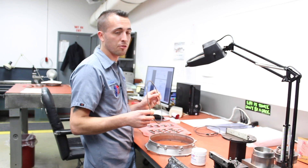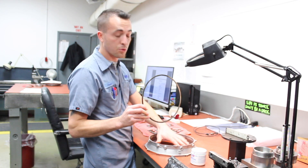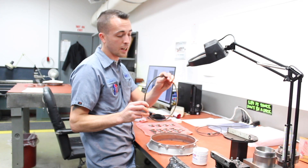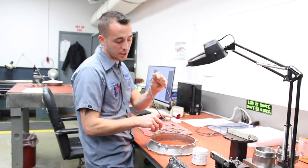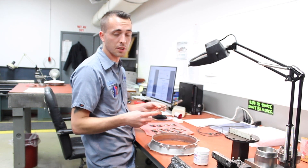It kind of chafes and flakes and won't seal properly. Another spot is on the inside of the seal rings — for the 2127, the inside and outside — as they wear, you get a sharp edge. You also have fretting on the inside, which is going to hinder performance as the seal ring wears out and stops doing its job.